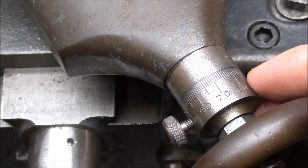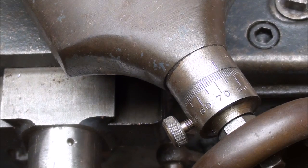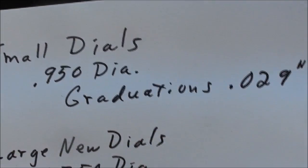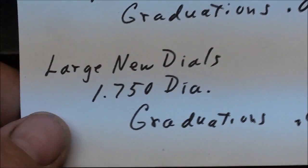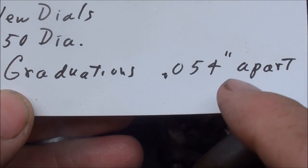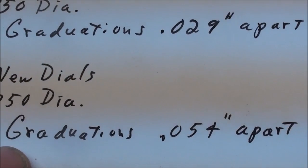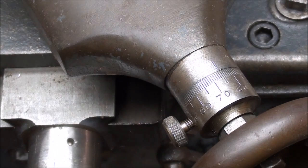To make the point even clearer: comparing this very small dial, which is less than an inch in diameter on the compound, with the new 1.75-inch diameter dials I'm making — using the formula PI×D on the small dials, which is 0.950 diameter, that puts the graduations 29 thousandths of an inch apart, so they're really crowded. On the larger dial at 1.750 diameter, the graduations are 54 thousandths apart, which is almost a sixteenth of an inch. This almost doubles the distance between graduations and really helps these old eyes looking through cataracts read the dials better and work more accurately.